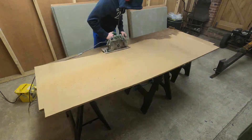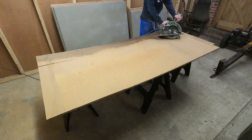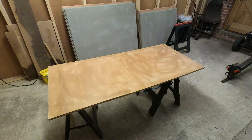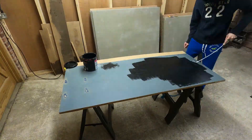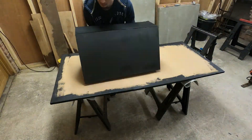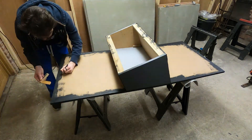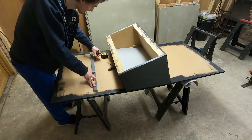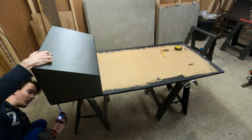What I'm doing right now was a huge mistake. You can see this piece of MDF is incredibly water damaged in the top area, and on the far left of the piece there was quite a lot of warping. I chose to use the piece anyway. Looking back, I wish I'd have just gone out and bought a new piece of MDF, but at this point I really just wanted to push on and get the project finished. This time with painting I decided to use a roller just because it got the paint on a lot quicker and provided quite a nice finish — not the nicest to look at, but for a back panel I think it's perfect. I'm just transferring the measurements of where those braces are on the base piece to the back panel, allowing me to pre-drill some holes and drive screws in from underneath so I know the base is in the right position.